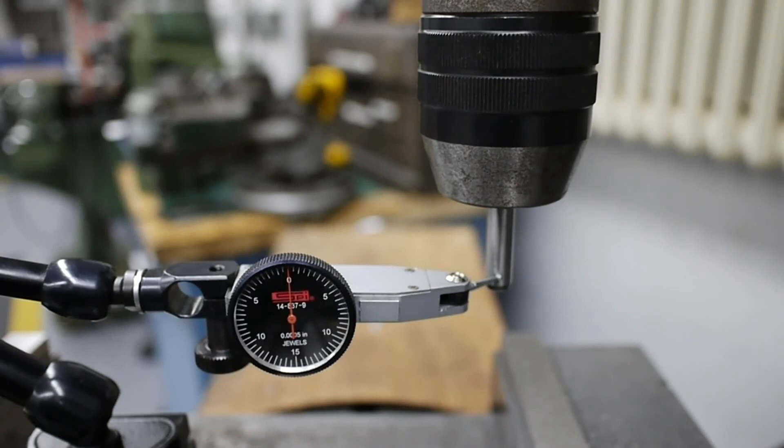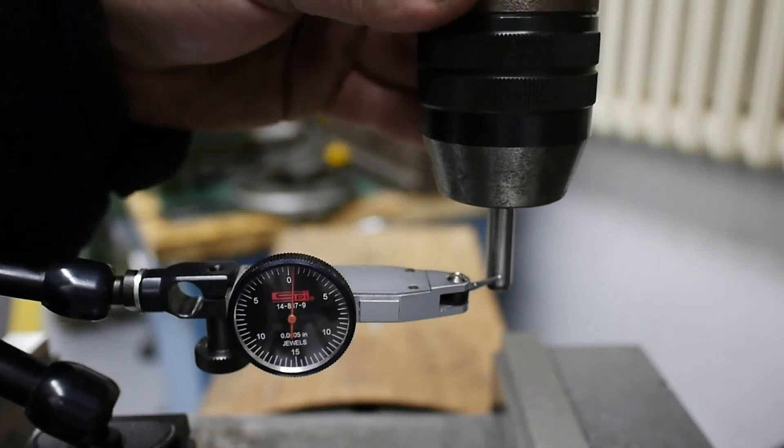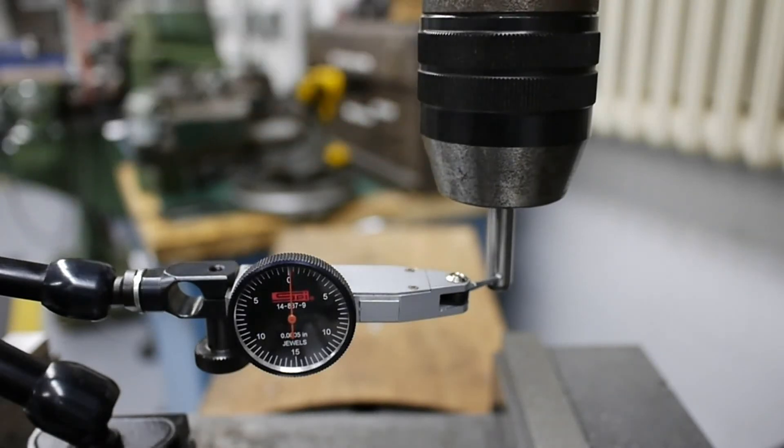If I had a tenth indicator I'd show you more precisely, but this is what I've got. That's just hand-spinning this chuck in neutral, which can account for the tapers not being in perfect shape anymore on the machine, or the bearing having a little bit of movement — if I apply pressure to the outside edge there's a little wear. But this mill's not new so it's got some wear in it, and it's still running pretty dang true. So I guess that'll be a wrap and I'll catch you guys on the next video.